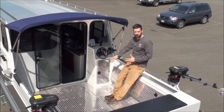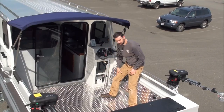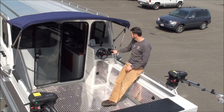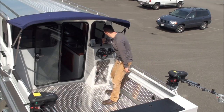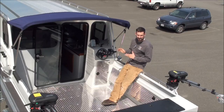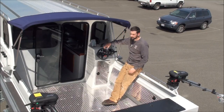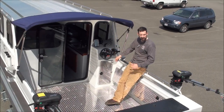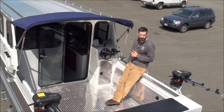Here's what the rear station looks like with the added storage box below — locking storage with a shelf inside and a Charles isolation transformer at the bottom, which is part of the shore power system. It has steering connected to full hydraulics, and shift and throttle for the kicker engine. He has a ram mount where he'll put an iPad in a waterproof case — because the Garmin system wirelessly syncs to the iPad using free Garmin apps, so he can see depth, GPS, charts, and everything from the back. You take your iPad home and use it for everything else.